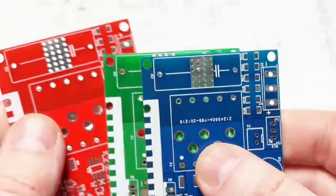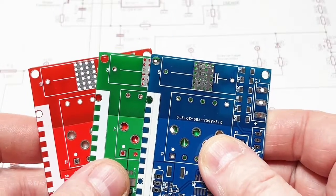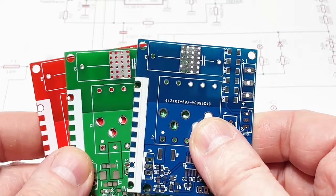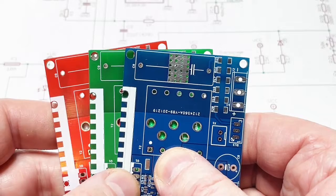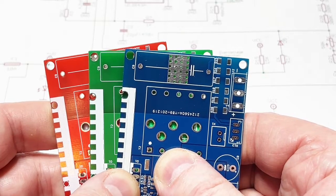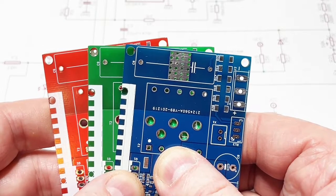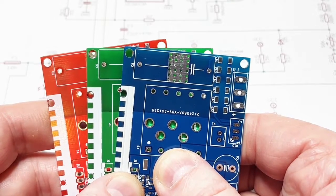The reason I made them is because I'm using these modules as high voltage generators — for example, for one of my future designs that is a capacitor leakage tester, with up to 1000 volts. Why such high voltage? Because I'm using capacitors that go up to this voltage. If you test a capacitor at a very low voltage and it shows good and perfect, that doesn't mean it won't be leaky when it reaches its specified voltage.